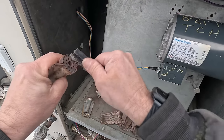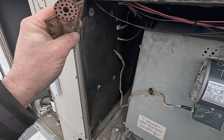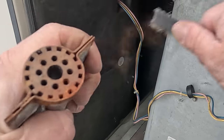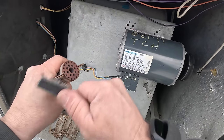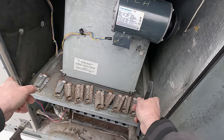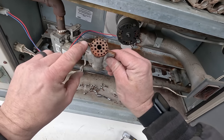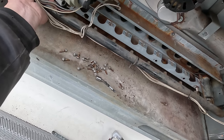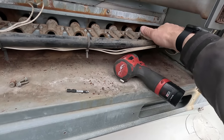Move on to the next because some of these are pretty bad. The middle is not the big issue — it's these crossovers which may need a piece of sheet metal run through to clean them out. This one's pretty bad too; this one might end up getting put on the other side upside down if it needs to be. There's really no right side up, but I always like to have this side like this. We're going to put the two crap ones at the very end — the crossover section on the right and the crossover section on the left. If you put one of the bad ones in the middle it pretty much kills your chain going all the way down to the flame sensor.